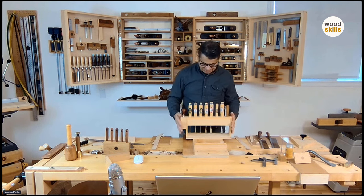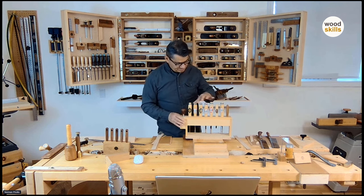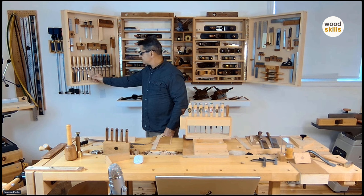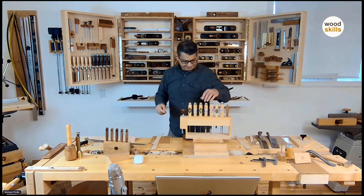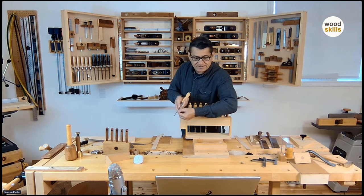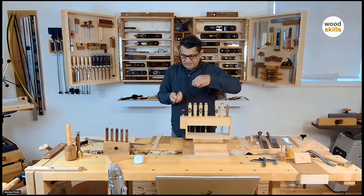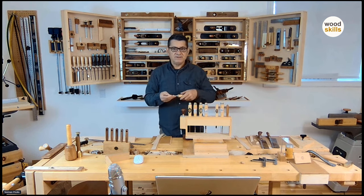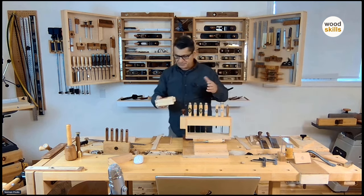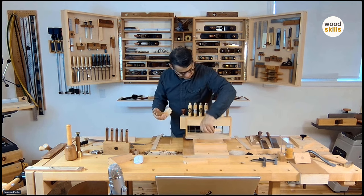This chisel rack is customized and portable, with a little addition on the hull. These are the chisels I use most often. I do have other chisels — mortise chisels and premium Richter chisels that have a very small land. The land is the side of the chisel. If you're doing detailed work and dovetail work, you really want a small land, because if you don't have a small land you tend to mar or dent the wood when working in a small area.